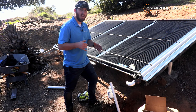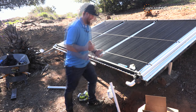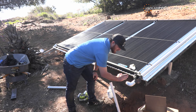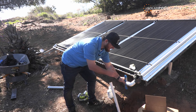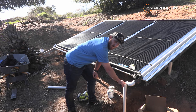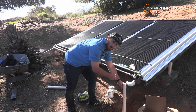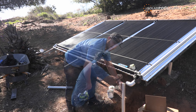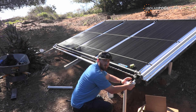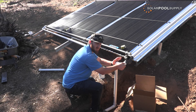Here's a little plumbing trick on how to connect a pipe from the rack, which is on an angle, into a trench that is flat. Right off of my two-way valve, I have a 90-degree elbow and I use my level to make sure that this part is 100% level left and right. From there you have a piece of pipe coming straight from the ground connected to a longer pipe pointing in that direction. You just use a simple 90-degree elbow to connect from the rack into the ground. A little tip for when you do glue joints: hold both of the fittings together for about five to ten seconds to make sure they do not want to separate after you let go.